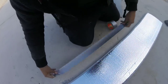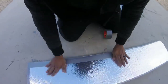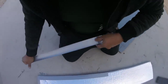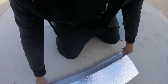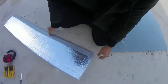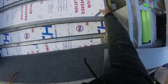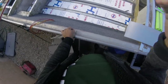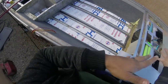I decided to reapply some tape down here to give it a little edge, because after some exposure to moisture and rain, the ends that had a bigger overlap didn't budge, but the ends that didn't have a big overlap started to come up. It was really surprising because the stuff is super strong, but if I want this styrofoam to last and be resistant to any gasoline spill, residual mold, or rats getting in and eating it, I'm going to have to beef this up. That accounts for the slight bevel, and it'll squish down when the subfloor is riveted on top of it — it won't implode or crush — and we have a pretty wide channel down the split for water to go in and out.